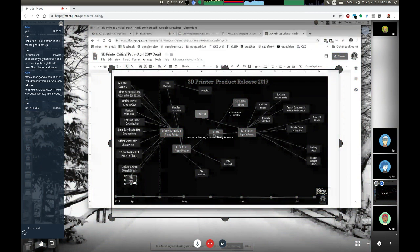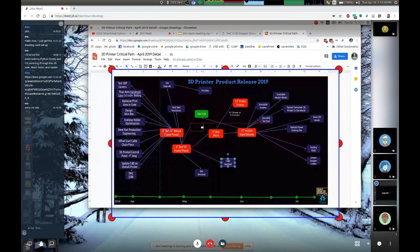These new drivers are highly configurable for completely quiet operation and sensorless homing, detecting when they hit something. Also, when you lose power, they have the capacity to return to proper printing because they can remember where they lost power. That feature isn't in Marlin yet, but Prusa printers have it in their own firmware — which is based on Marlin — though it hasn't migrated to upstream Marlin yet.